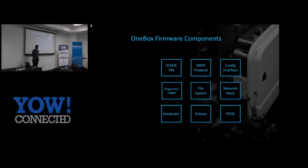The other thing that we needed to use was the DNP3 protocol. Many people might not know it. It's quite common in utility industries. So in this case, water industry, it's a messaging protocol, basically, that ensures reliable delivery. It works over TCP/IP, serial port, wire, wet noodle, I don't know. It's basically a self-contained protocol, so we grabbed it as a third-party library and then integrated it.